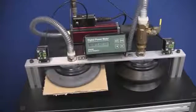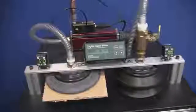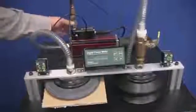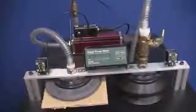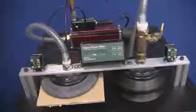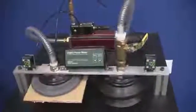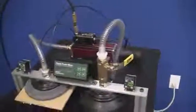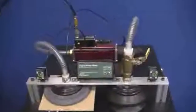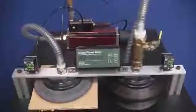Now another feature of an air-driven generator is that while they're smaller and quieter than a mechanical system, they can be mounted much closer to the application. Doing that, being closer, the performance is better because of less system volume, fewer potential restrictions, and less loss through the vacuum tubing. And this is one reason that too often generators are sized to be exact replacements of a mechanical system, where they can usually be smaller, give the same performance at the application, and naturally use less energy.